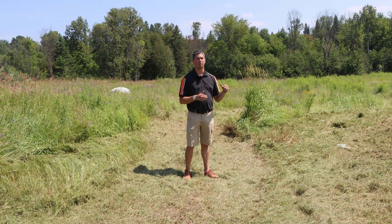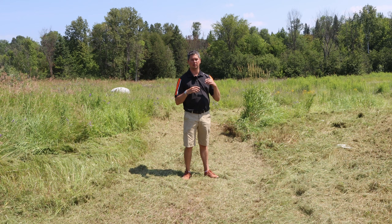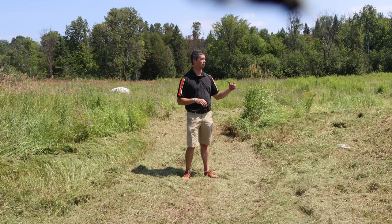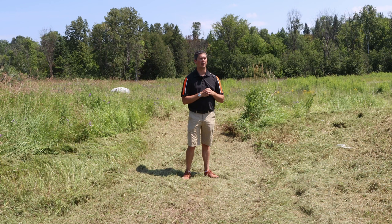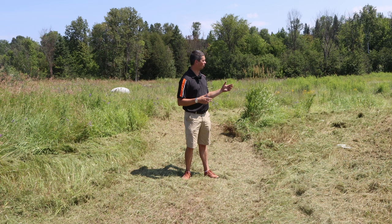And again, you can see that right off the bat, that flail mower has that rotor with a bunch of teeth spinning there, so it's hitting that grass 3, 4, 5 times before it's spitting it out. Whereas on the flip side, the rotary cutter is a two-blade system, and it has to really push that grass down to go over top of it. So you're going to see that tuft of grass or brush pick back up again as those blades have missed it. So that's a quick overview of what finishing is going to look like from one machine or the other.